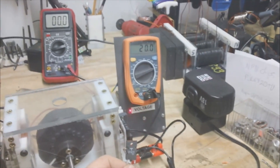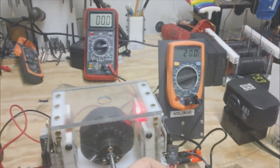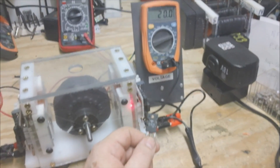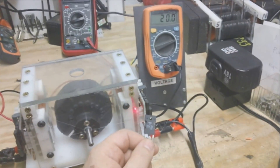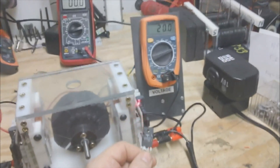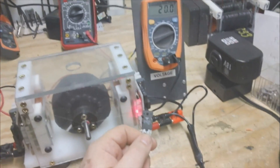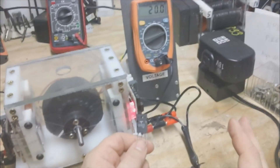They're rated at about 15 amps at about 700 volts. The Fairchild one, which is an FJL6920, is rated at a max amperage of 30 amps, average amperage of 20 amps, rated up to 1600-volt high voltage spikes, and runs at about 800 volts normally.